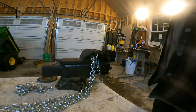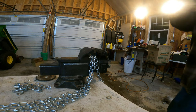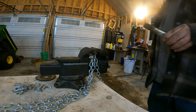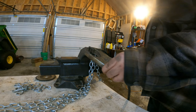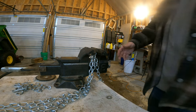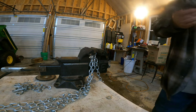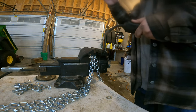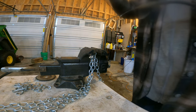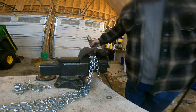So it's not exactly coming back into just the way it originally was. Hopefully I can weld this now without getting the GoPro. I'll try not to. I'm just gonna hook my ground onto the screen around here. I'm just gonna hook it on the back of here. That should do it because that whole channel piece is kind of part of here. And then we don't have to worry about our ground so much. Do a little weld. No, our ground's not working out. So we're going to put our ground around the other side.